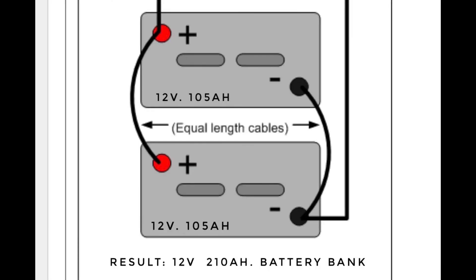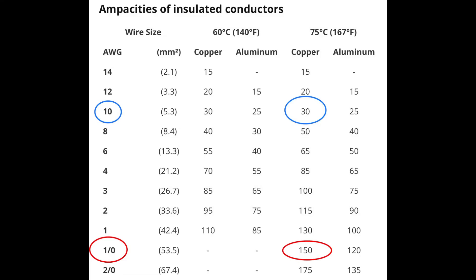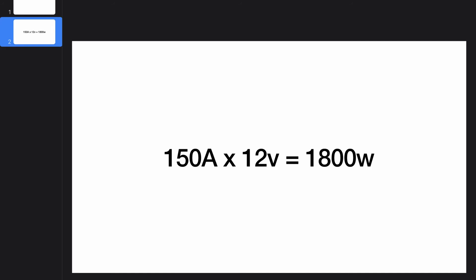Here's how I hooked everything up. I have one wire going to the input side of the shunt, one wire hooking the two negative posts, one wire hooking the two positive posts, a negative wire going to the negative terminal on the inverter, and another negative going to the output of the shunt — this allows your battery monitor to function properly. Here's a quick diagram of the battery setup. I used 1-aught gauge wire that's rated at 150 amps — 150 amps equals approximately 1,800 watts.